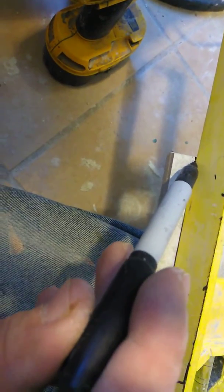All right, so there's my 3/4 of an inch mark there. I bring this here and I move this down to this edge here. So we go from 3/4 of an inch on the pivoting corner, and then I scribe a line from this point all the way across to the outer edge right there, to nothing.